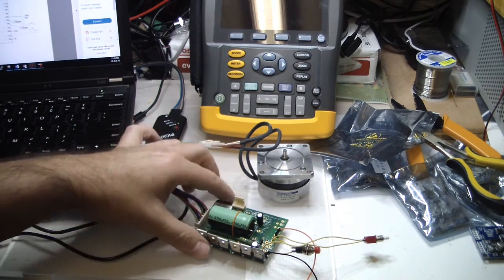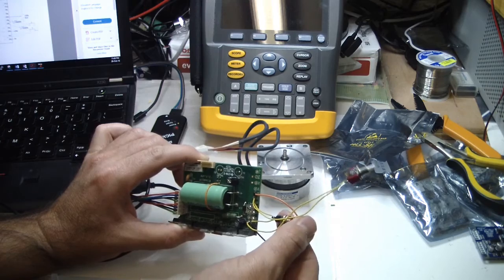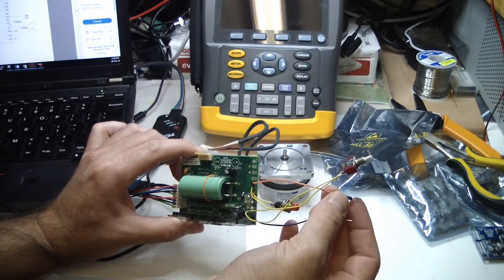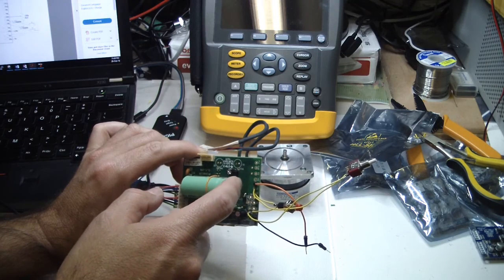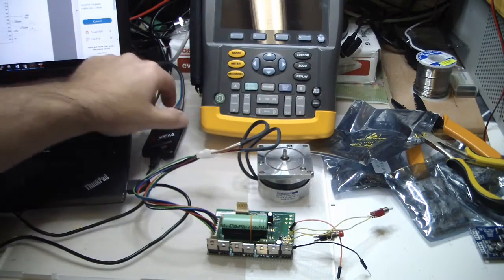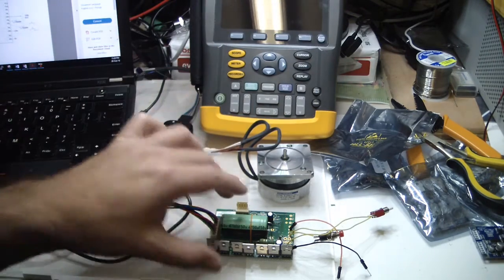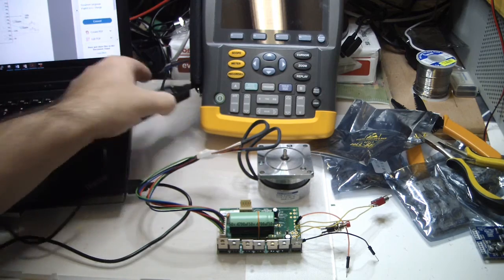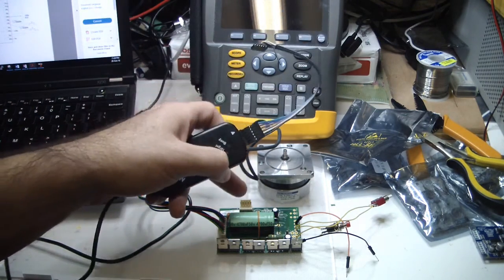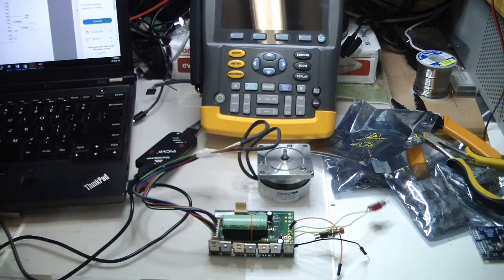Okay, so I did all the soldering work, connected everything according to the datasheet PDF that I got. This is the start, this is the stop, this will be the speed, and I've checked the power on the capacitor, so I can connect power directly to the capacitor. And just in case, because I've got also a hex file, I've connected PICkit 2, so I will be able to burn new code and also check the datasheet, and the connector is not connected one-to-one here in order to burn a code. So I did all the wiring, and again this is a new board, so I've not changed anything yet, and let's check if it is working.